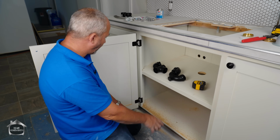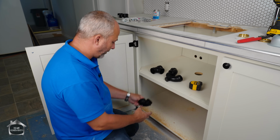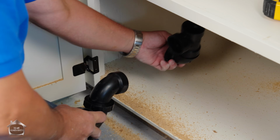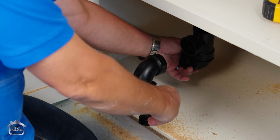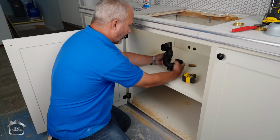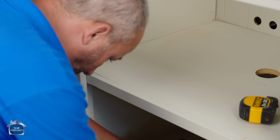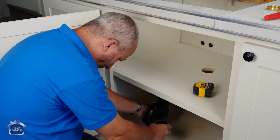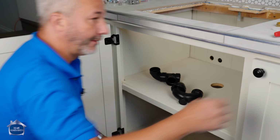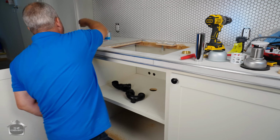So in behind this wall, I've got my drain line running pretty much lateral coming across. So I'm going to bring it up on a 90, stick that fitting on there, and then connect with my pipe to my drain inside the sink right here. So what I want to do is I'm good to come across at 21 inches. That's my hole, right? So I'm going to be basically going like this, but I got to drill my hole where I want to have my lateral come through at a comfortable spot, right? Considering the depth of my sink, the depth of the tailpiece, the depth of this, and then I have a conversion here.